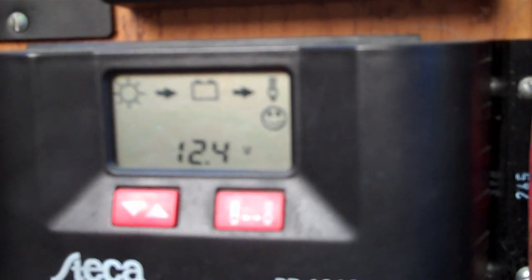The display's pretty simple to use. It's quite useful because it shows the present voltage that the batteries are at. We've got a little sun symbol effectively saying that there's charge going into the batteries, and a lovely smiley face that's decided that our batteries are actually in a pretty good state of charge. We can scroll through the controller — the next screen shows how much input we're actually getting from the solar panels right now. We're getting 2.3 amps right now, and the maximum we've ever seen is just short of 5 amps, which is about the capacity for these panels.